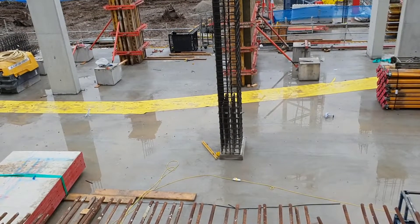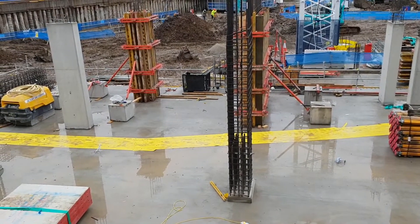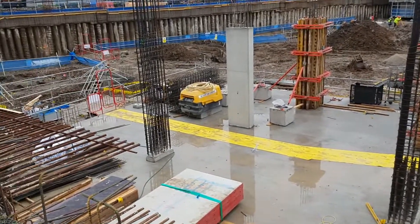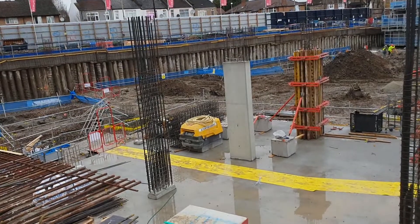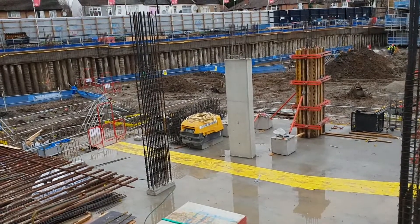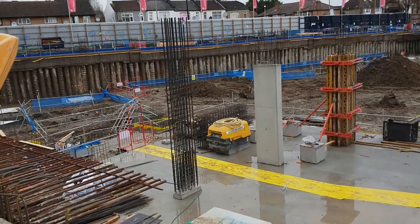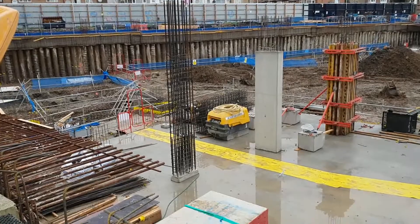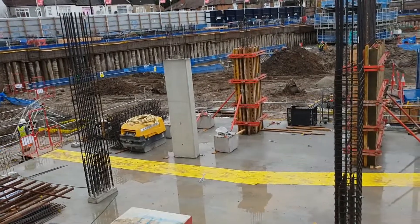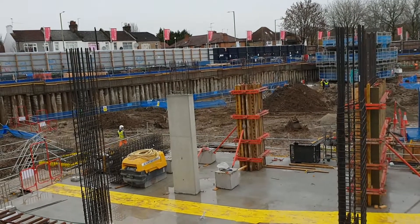That's the kicker — it really helps when you're going to put your shutter. Your shutter just gets to the kicker and the column is poured. You can see the steel here, with the kicker poured. The steel has to be checked. The guys are bringing in prefab cages, so the steel is not fixed on site. The quality is very good. This has to be checked before pour — the QA inspection — and then your column is poured and ready.